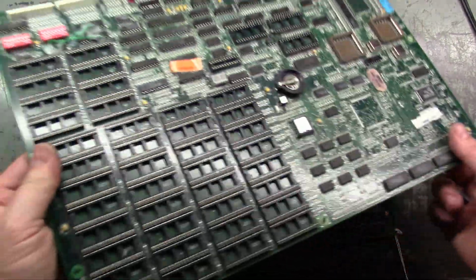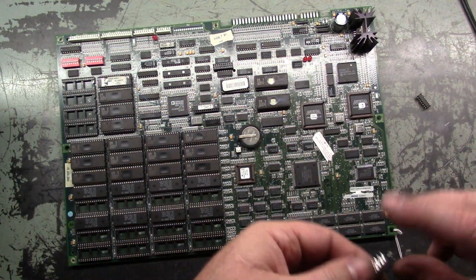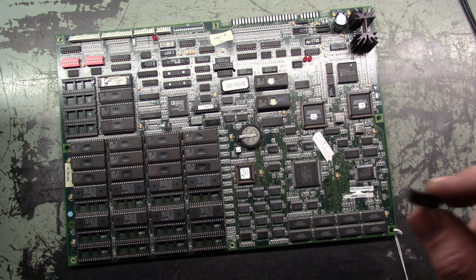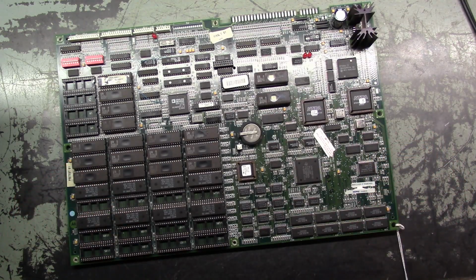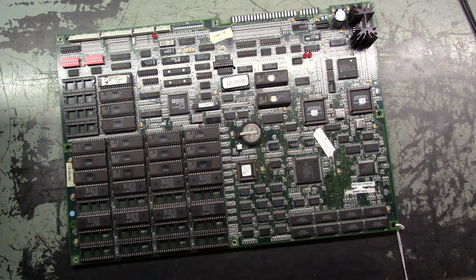You can see it's completely empty. And so it turns out this is actually okay. The DAC chip's actually okay. The problem was the op amp, just like I thought. I did test it off camera and it works perfect. So, yep, my theory was correct. Bad op amp, U92. If you have this problem, replace that chip. So let me show you. I'll cut away here and we'll turn it back on the test bench and you can see it in action here. One moment.